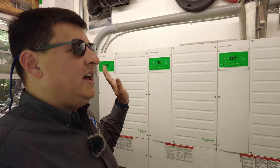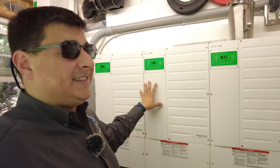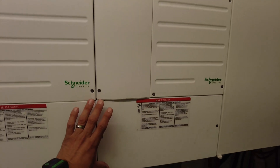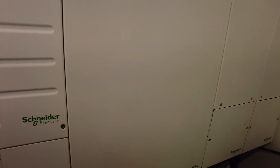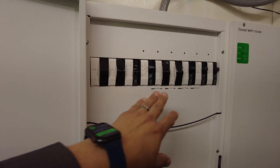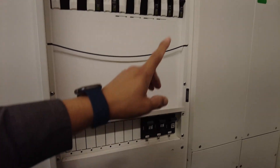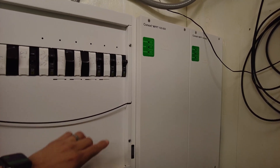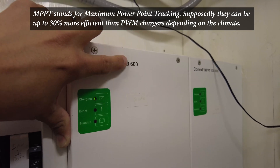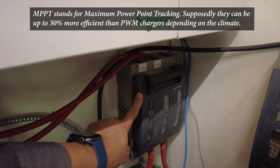As we progress towards more things running off renewable energy and replacing propane with electric devices, we decided we needed the extra capacity. Inside the shed: one inverter here, and below it a wiring junction box. Next to it is the Schneider AC/DC breaker panel — AC breakers up top, DC breakers for the three Schneider inverters below. Then we have the two solar charge controllers — MPPT style, maximum power point tracking. '100' refers to 100 amps DC output, '600' is the maximum DC voltage input. One is labeled the south array, pointing roughly west.